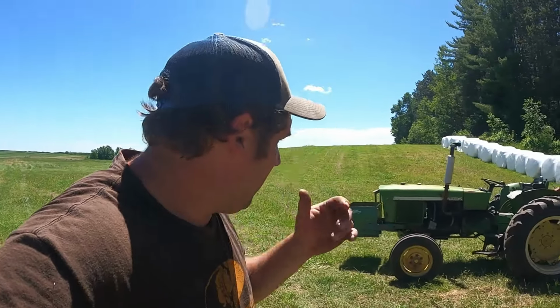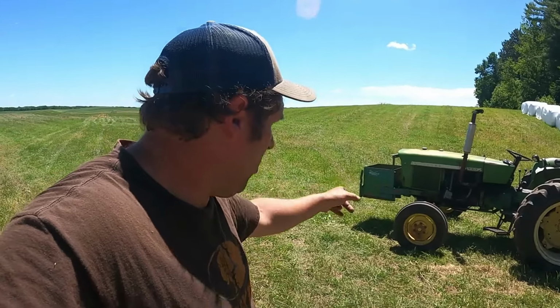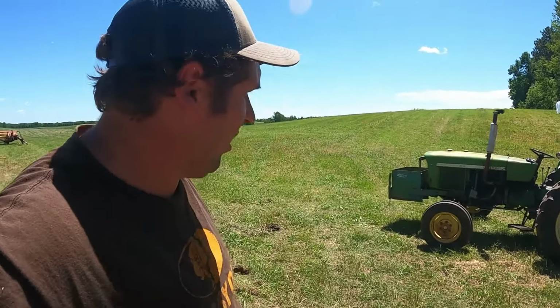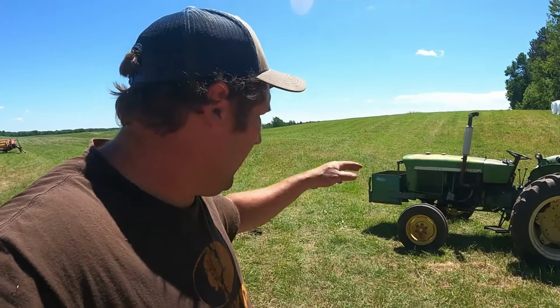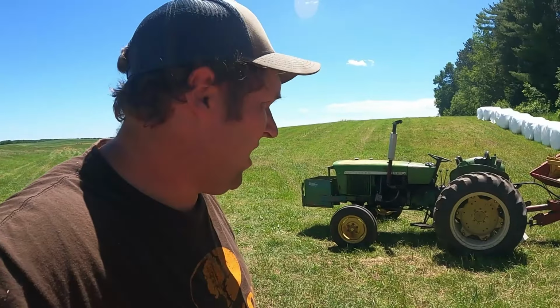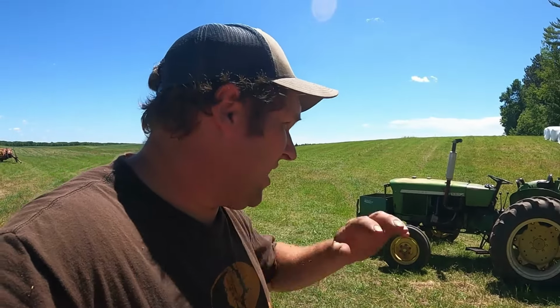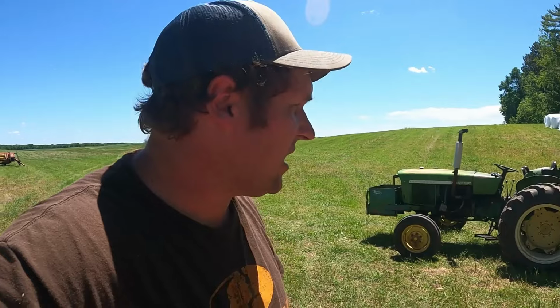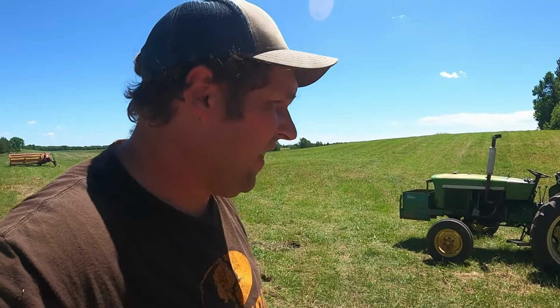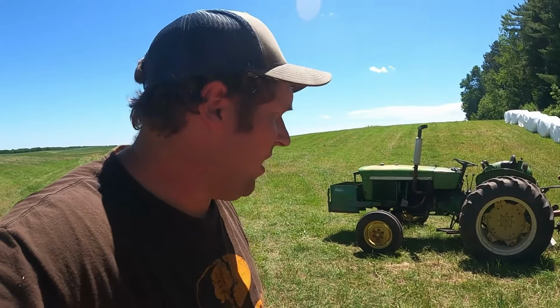But switch machines. I brought the tractor back in the yard, hosed out the side panels and the radiator a little. It was running a little bit warm today, but they were pretty gunked up. I haven't sprayed them out in a while, so I think it'll be better now. So I'm gonna take this out and do some more cutting, but I guess it's about the same as the other one. But I've run the other one enough to know that all the major components seem to be working well. It was cutting good. Didn't have any other issues, so I don't think that's anything too major, but we are gonna keep going with the old one.